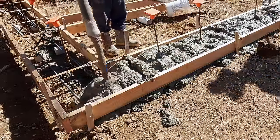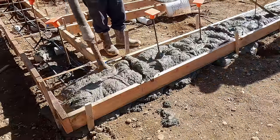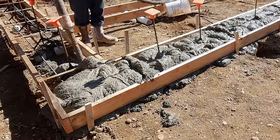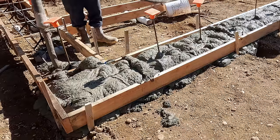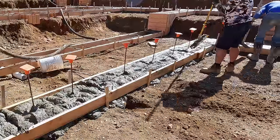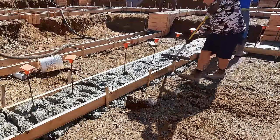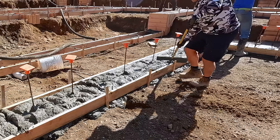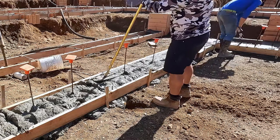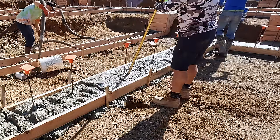Here's a better angle of the gap between the bottom of our two-by-six footing boards and the dirt. I get a ton of flack on Instagram every time I show these clips because people think there's so much waste and spill-out. I've actually gone through and calculated — if there's any spill-out we just pick it up and put it in the footings. Those little globs amount to about two five-gallon buckets by the time we run 340 to 350 lineal feet of footing. That's nothing.